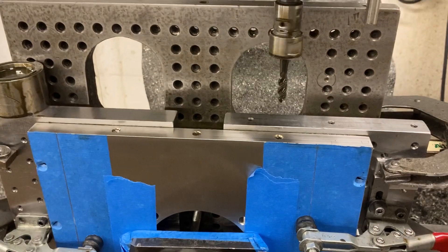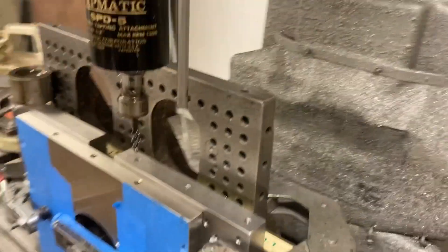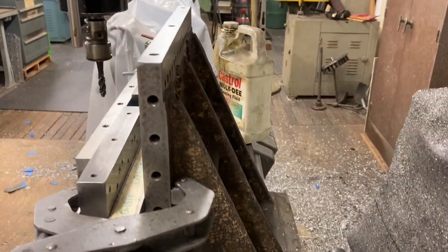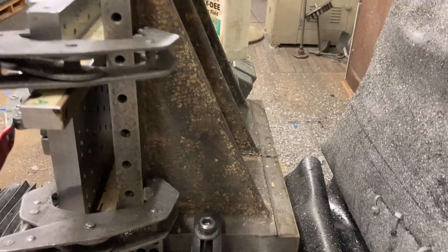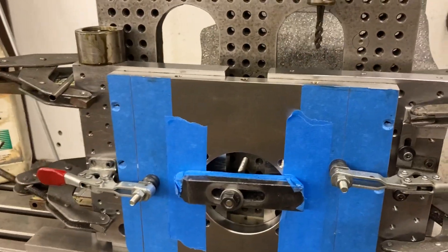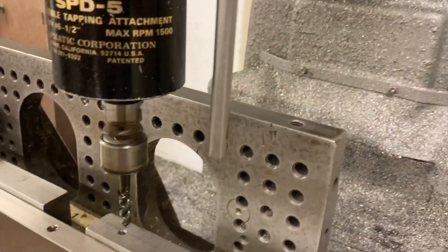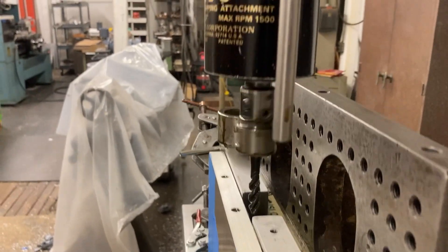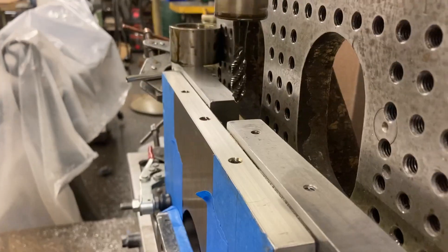It was a little funky trying to get it set up here because they're kind of tall. So I got this big angled knee — you might have seen it in another video where I used it when I took the broken studs out of the Harley Davidson head. The problem is that the part doesn't stand off of the back wall of that knee far enough to clear the diameter of this head and put the tap on center for the hole.